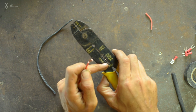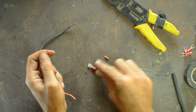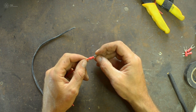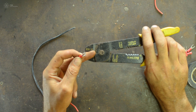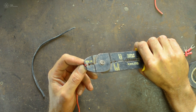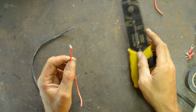After cutting and stripping, if you want to add a crimp connector to the end of a cable, twist the cable slightly, trim a little, and insert the connector all the way onto the wire. Then use the crimping tool — it has three different slot sizes, use the smallest one if unsure. Place it and apply firm pressure. The connector is now securely crimped onto the cable.